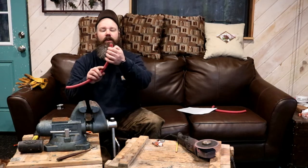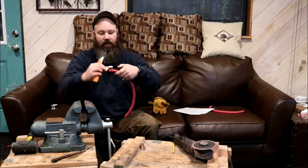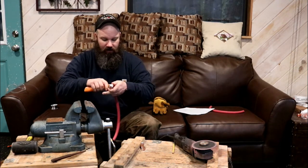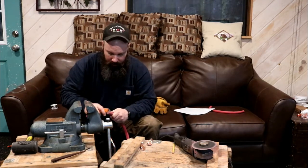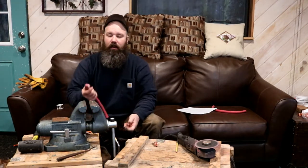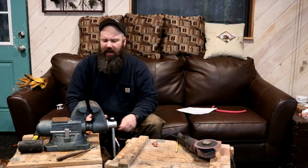We've got to cut down as far as we want to expose the bare copper wires. What I do is put the cap on the end, measure down, and cut about a quarter inch past where it's going to seat. That gives us a little exposed wire for soldering. Then we slip the caps on, solder them, and punch them. I tried using the vise to crimp it, but it didn't work out too good, so I think soldering and punching will do a good enough job.